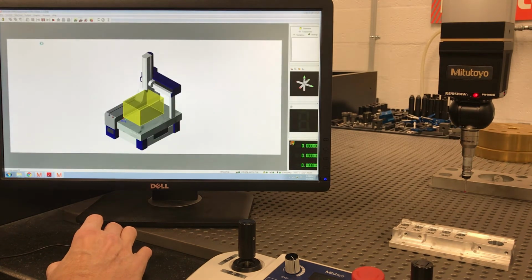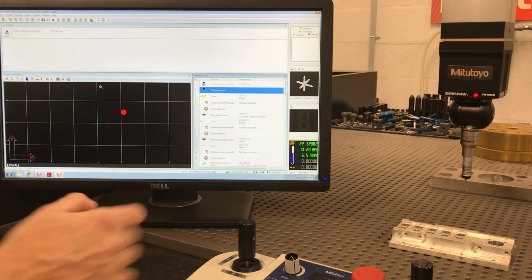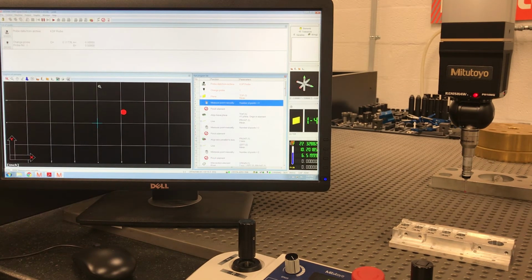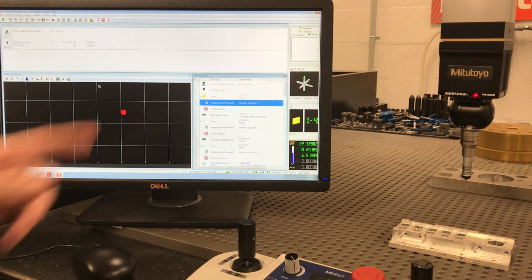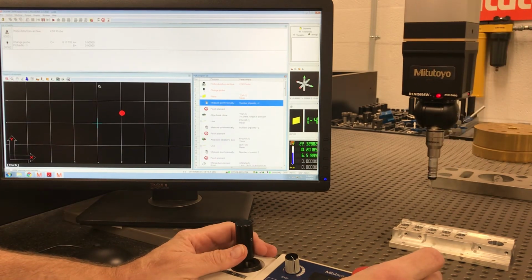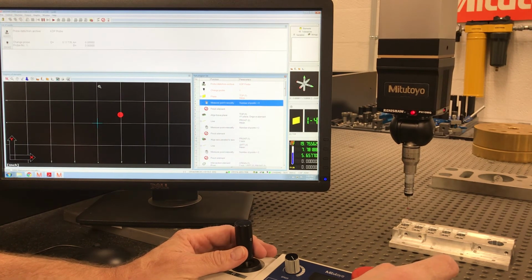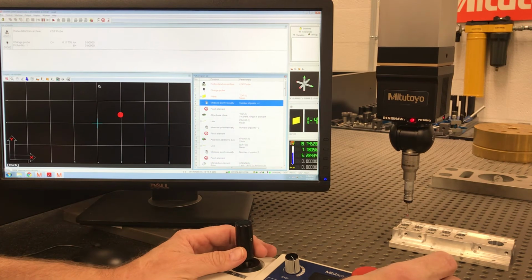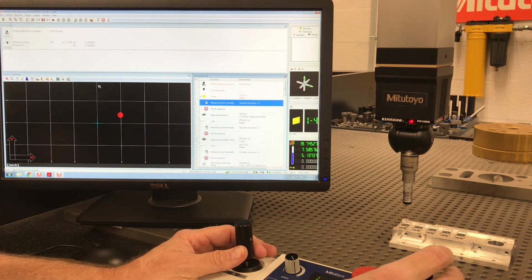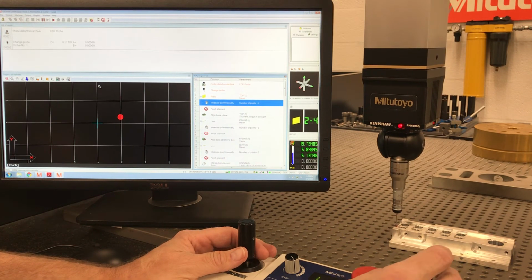Now it's going to be the test of time if I got this right. So, all of the clicks with the mouse I don't have to do when I'm in run mode. Repeat mode is what they call it. Since it's already done everything, and now it's waiting on me to hit the 4 points. So I'm coming over here. And again, this was not within CNC, so I don't have to worry about the go-tos. You'll see those in a moment. So all I'm doing is just measuring these 4 points until it can get an alignment, and then it'll take off on its own.